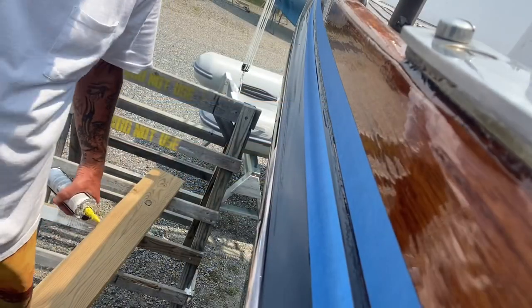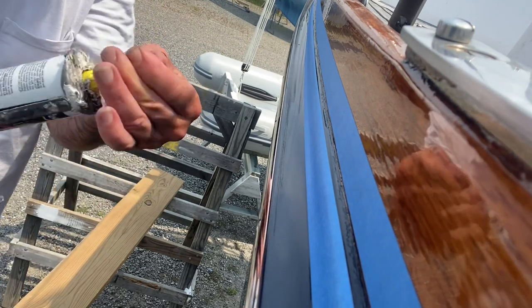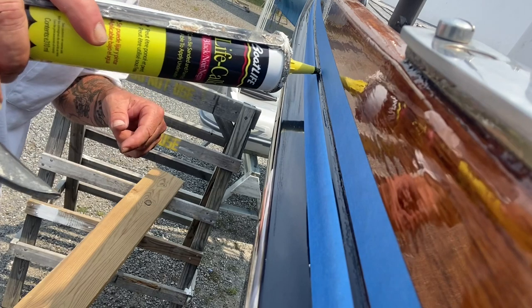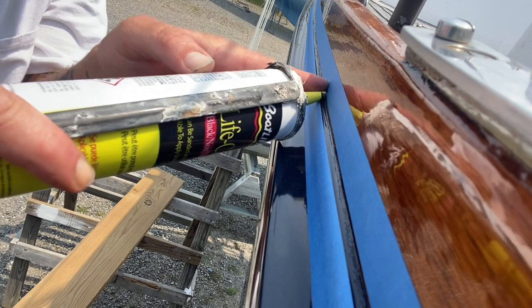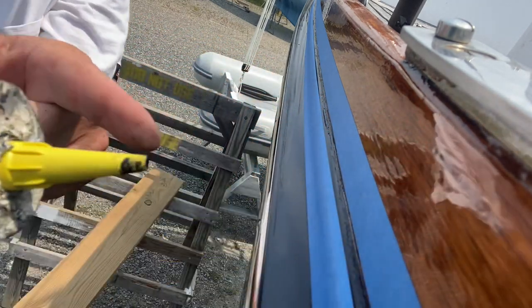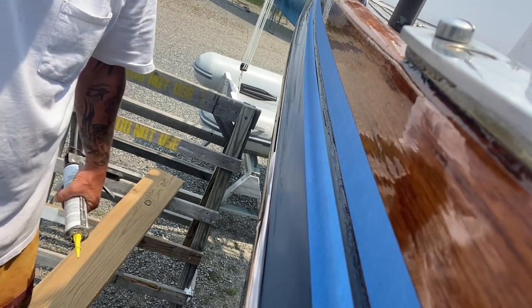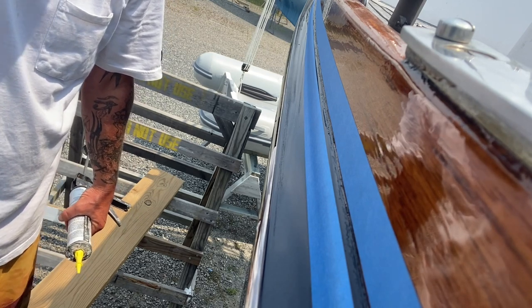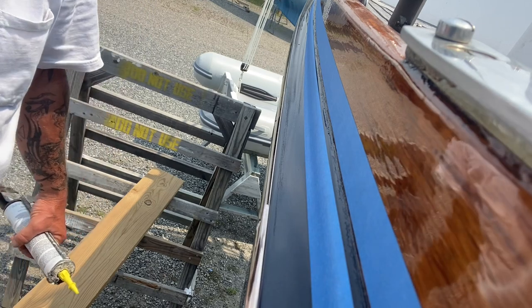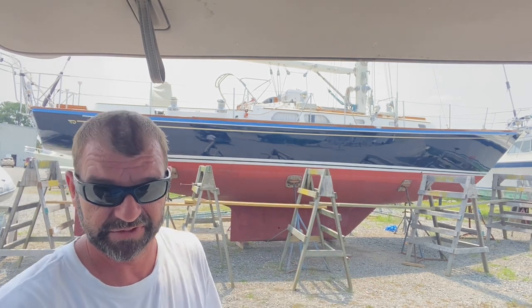Just to show you real quick — I'm not going to be able to have the camera up here covering how I do this — but I'm gonna take my caulk, and what you do is put it where you need, stick your finger on the back side, and just squeeze and rub in one continuous motion. It leaves one solid, consistent bead and it goes really quick. I'm gonna set this back up at a distance so you can watch me do this, and then I'll show you up close after it's done. I'm going to do this in real time and I assume it's going to take me about two minutes to run this bead.